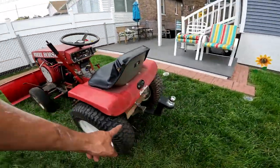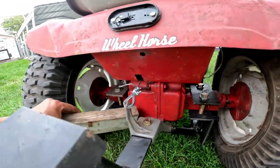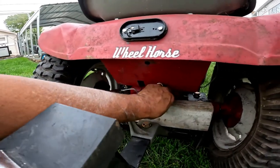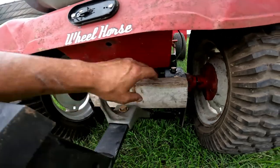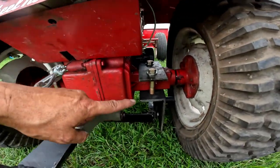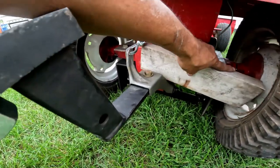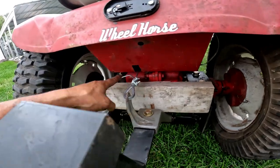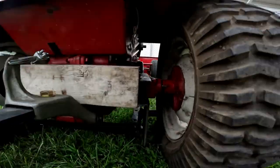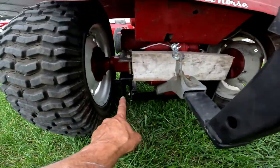My son mocked this up because on the back of the wheel horses, this block is here so that when you back up, this won't knock against it. I'm going to mock this up so that when it leans up, it's not going to hit the transmission at all — it's going to be braced on the axle. That's what the snowplow is braced on: the axle right there. But if you have this type of hitch and you back up, it will hit the transmission. So I'm going to cut around this and whittle it out. This is resting on the brackets right there — it's fabricated. There are little spigots that come out, and it's onto the plow right there.